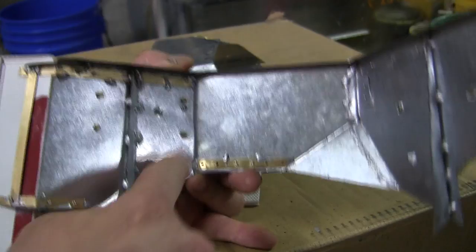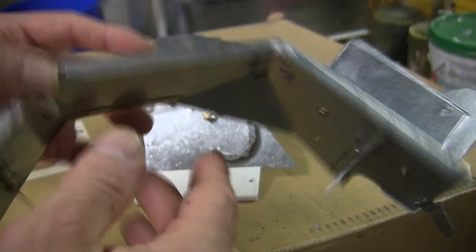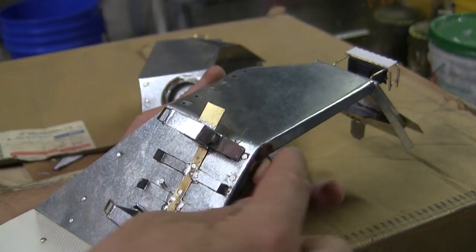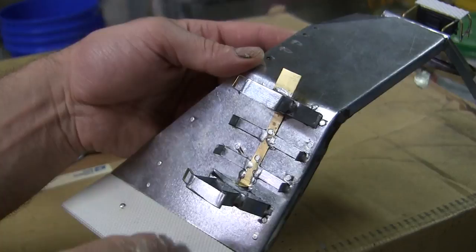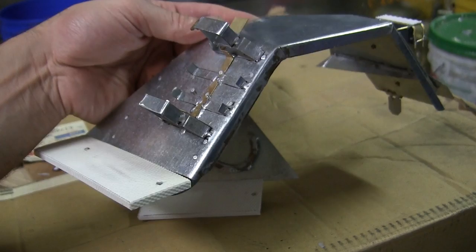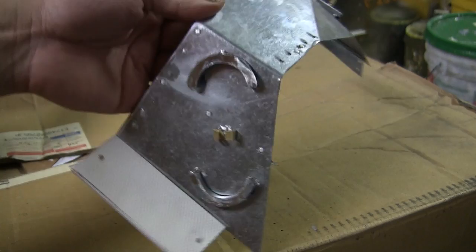One thing that's interesting about the rear fenders which differs from the front is that the rear fenders have a lot more rigidity and more braces on the interior portion. The rear fenders support more weight and components compared to the front fenders, which have a small cubby space but not much load bearing. The rear fenders must hold up the jack and other components, as well as the weight of a person mounting the fenders to access the engine and the top of the turret — which is why there are footrests on portions of the fender. Without these rigidity pieces these fenders would be much weaker.